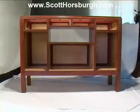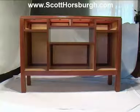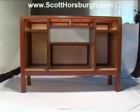There you can see what it looks like with the backs in place. So the backs are very simple frame and panel construction. The panel is veneered, as you can see, Jarrah on the outside and the white birch on the inside. So you can see how nice and bright it makes the interior of the carcass. On the left and right hand side there will be 2 shelves. And in the middle section there will be 1 shelf.